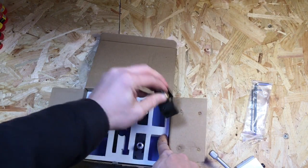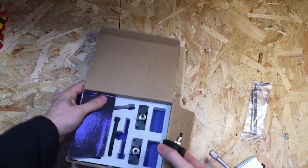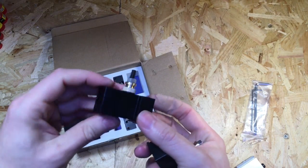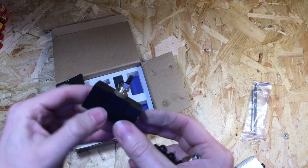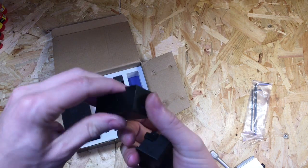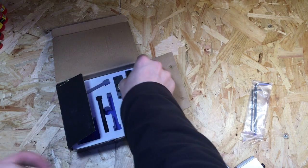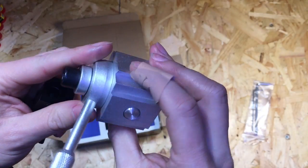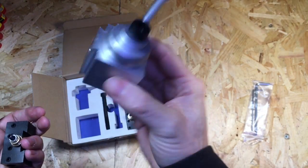There are two standard tool holders, and then there's a parting tool holder to take a parting blade. And then there's also a 3/8ths boring tool holder. They're all machined nicely. These tool holder pieces I think they're made from steel — yeah, definitely made of steel. The actual body of the tool post is aluminium, so it's not all steel.